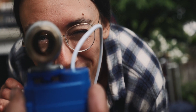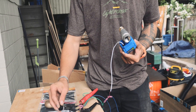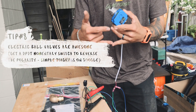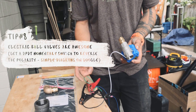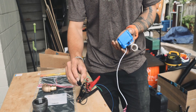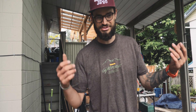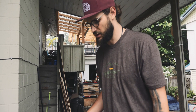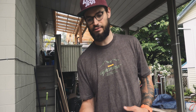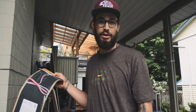Another quick water hack: running an electric ball valve on your gray water outlet tank. This is a $25 valve from Amazon with a dual-throw momentary switch with three poles — you cross-wire the poles so that when you run 12 volts to the pump, you can reverse the polarity just by the direction you throw the switch. The idea is you can be cruising down an old logging road and flip the switch from your center console to start dumping water — allegedly just thinking about the concept.